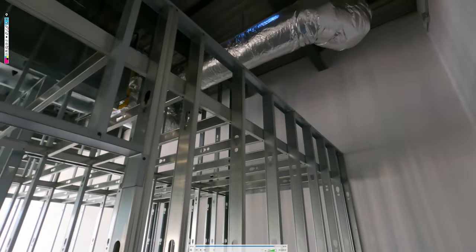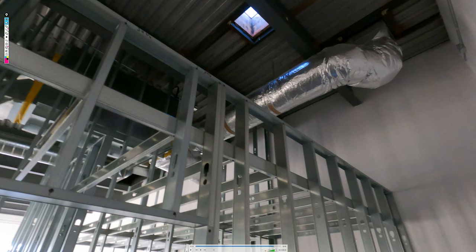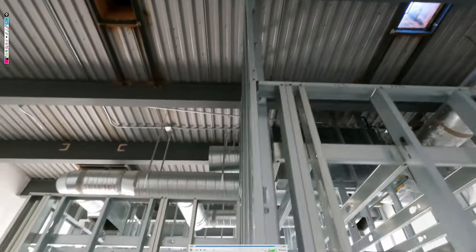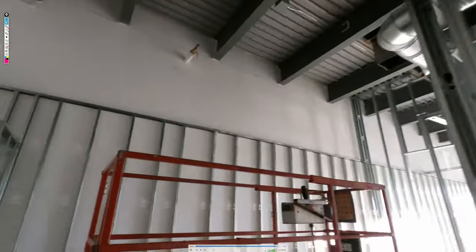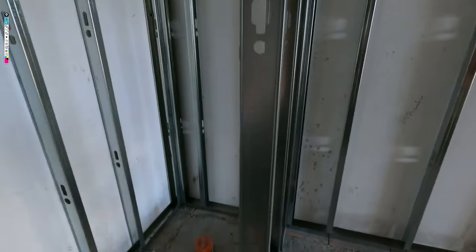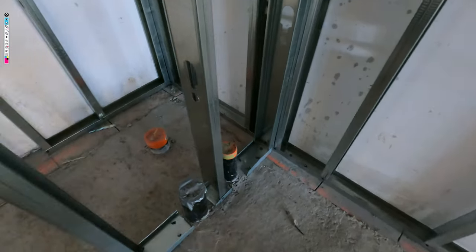So there you can see a stud against the wall too in the back there. All right, you saw that right here in the back. Use 1 1/4 drywall screws and hit your wall studs, hit your studs, man, and you're gonna have a super super strong ceiling. No issues, right? And that wall didn't have to go all the way up. They got a freezer in this one. This is for the mop sink. There's T-bar in the whole back of the kitchen at like 10 feet or something like that.